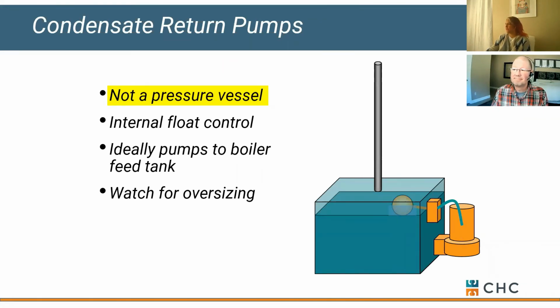If we treat with food grade chemicals for steam treatment, I'm not sure if that's the proper word or if it's a typo, does that resolve the issue for humidification? Oh, I would say yes. If you look at Seattle specifically, they distribute food grade steam. So you don't need double wall heat exchangers particularly. And yes, you'd probably be okay on humidification under those requirements. Obviously, that's going to be subject to your local inspector. But in general, that does open some doors for you. Very good clarification for sure.